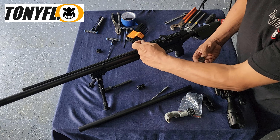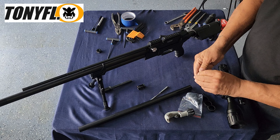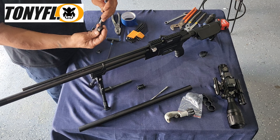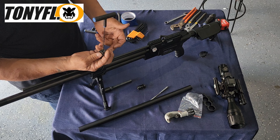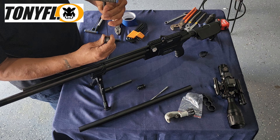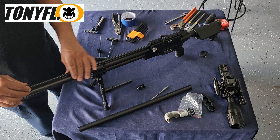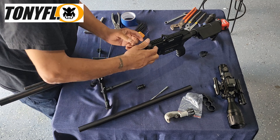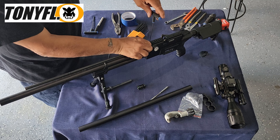Okay, we got the centering piece off the drill. Remember that the Allen key hole has to face upward and the hole is on the right side. Shove the dial pin back in with your finger. Grab a 2mm Allen key — back that Allen screw out enough so you can slide this piece back onto the barrel all the way down to the end, positioning it where it needs to be flush against your manifold. Then tighten the grub screw to secure it onto the barrel.